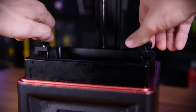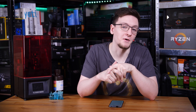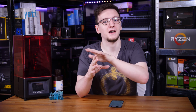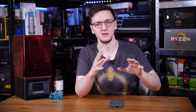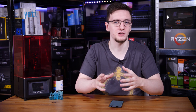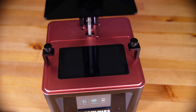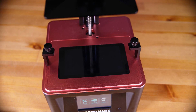Make sure that when you go to print, those thumbscrews are thoroughly screwed down, otherwise your print will fail. The print vat itself has a very thin plastic sheet under the bottom which you should be careful not to scratch or damage, as that's what holds all of the resin in. Under the print bed you'll find the display which does all of the curing.